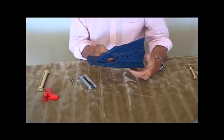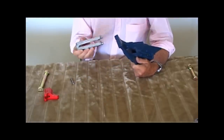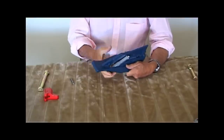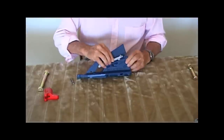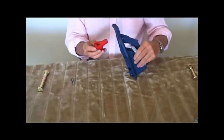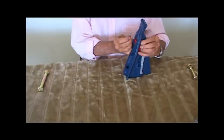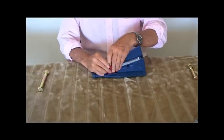Now we'll put it back together. First, when you assemble the thing, you put in the top hat. It's got little tapers on the side, so you put it in diagonally like so, get it through the hole, give it a little half twist like so, then it lays back and you can see those little catches there. They drop down into that hole and the whole thing fits back into place. Then you insert the rabbit, tail first, into his hole, poke him through there like that, and it drops down there like so. Then you get the little pin — or wand we call it — that recesses into there. You drop that down into that hole, put it forward, and the whole thing slips forward.